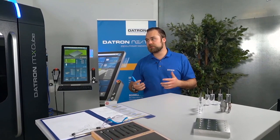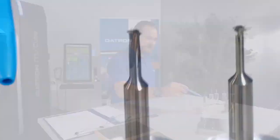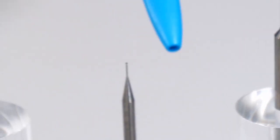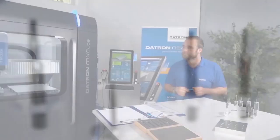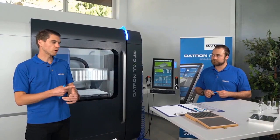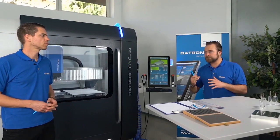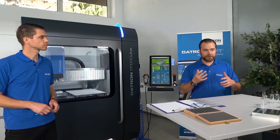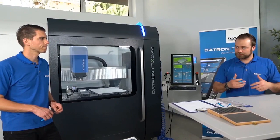The cutting flute of the new tool is also much bigger to give more stiffness and more power inside the tool. The new tools are available in different dimensions from M1 to M12. Here is an example with M1 on the left and M10 next to it - you can see the dramatic size difference. The new tool is one thread size per tool, and the old tools will remain available. The plan is to use a combination of old and new tools, with the new ones covering specific sizes like one tool for M6 and one tool for M8, to get the perfect combination of tool dimensions.